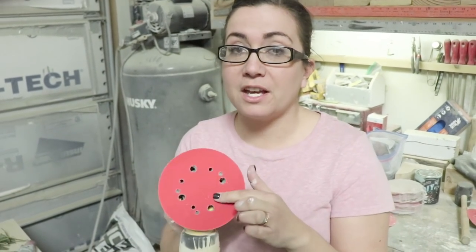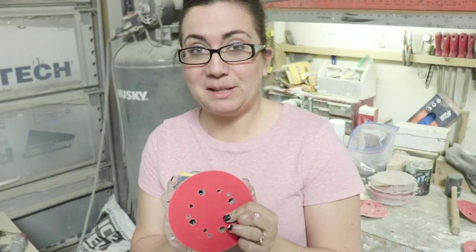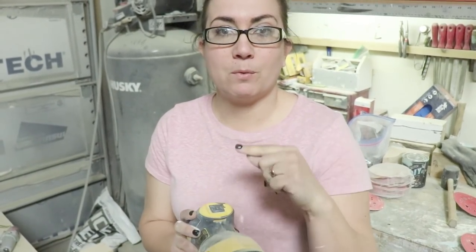We did two coats of the DIY White Swan. It is now dry, so I'm using my Orbital Sander with 220 sandpaper. If you watch me, it's kind of my go-to for distressing with the DIY and the Fairy Chalk Mother. I'm gonna distress it, get all the dust off, then we'll be ready to seal.